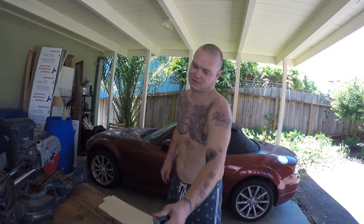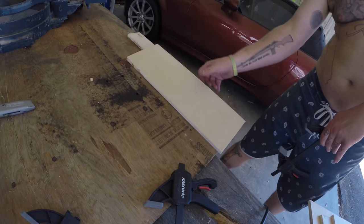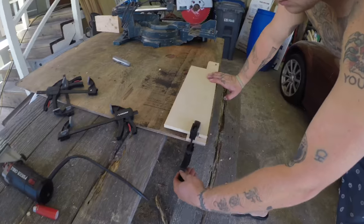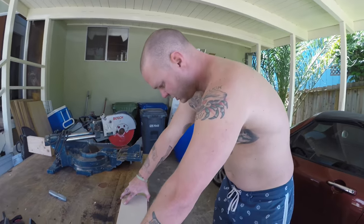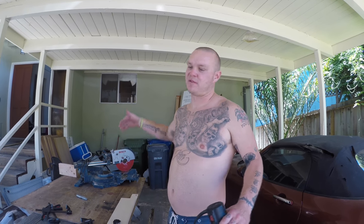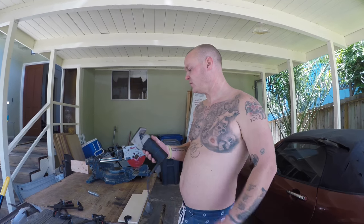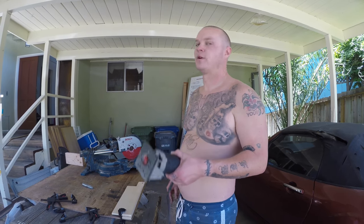Now we're grabbing the drawer faces and the doors. Trying this little trick. I'm basically gonna try and use this bottom piece as a continuing guide for the router, because the lowest setting we can put on it, with still having the bearing on the wood, leaves a little too much, and then the next setting, there's nothing to stop the blade from just digging all the way in. So I'm gonna try and put a lower guide and then clear the whole corner, see if it works.